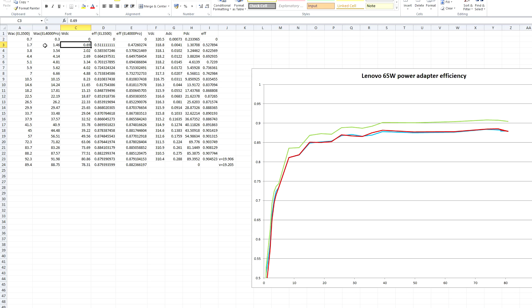I used my nice interface to draw a certain DC power, and at the same time I took a photo of the power meters. I had both power meters plugged in, and the power meters themselves use a little bit of power as well, so I compensated for that. Basically I found this wiggly line of the efficiency. Usually you expect at very low load the efficiency is low, but then you expect some kind of reasonably smooth line up. You definitely don't expect the power supply to have a slightly lower efficiency at a higher power in the upward bit — but this one does, and it does consistently.